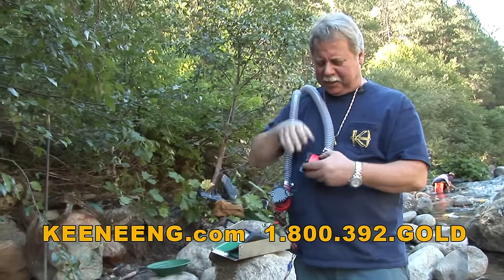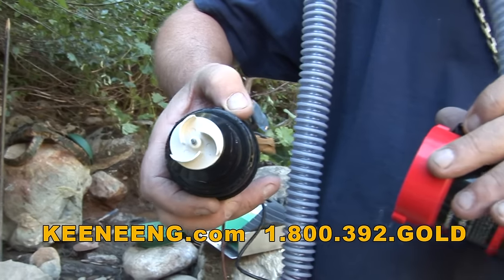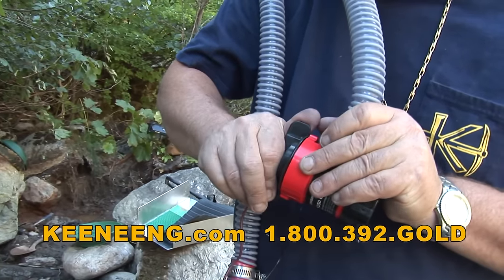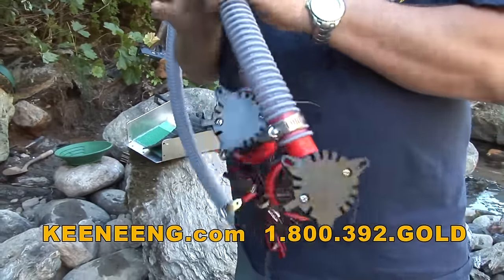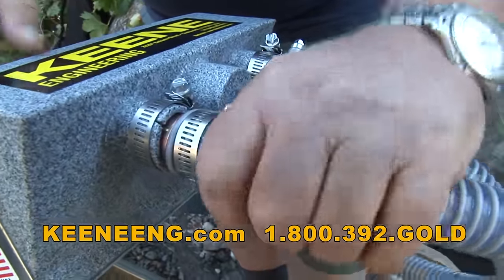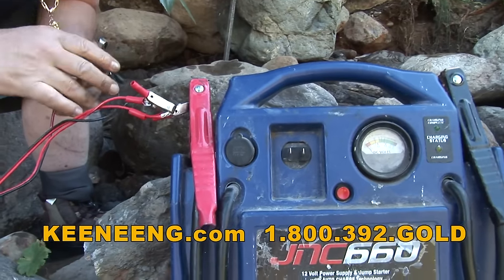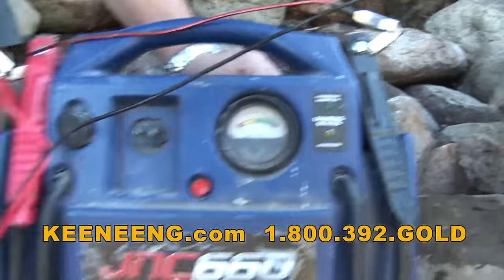It's almost set up. All we need to do is attach our water pump hoses and it's ready to go. The nice thing is these are 12-volt pumps, so the thing is literally silent. It comes with 4-foot hoses, clamps, and two US-made water pumps - not Chinese. You can pull it apart and have easy access to the impeller - there's a little lock that keeps it in place. Push it in and rotate it, push the little lock in, and that way you can clean out the debris. Insert our two water pump hoses - clip onto the negative - and there we go, we've got water.